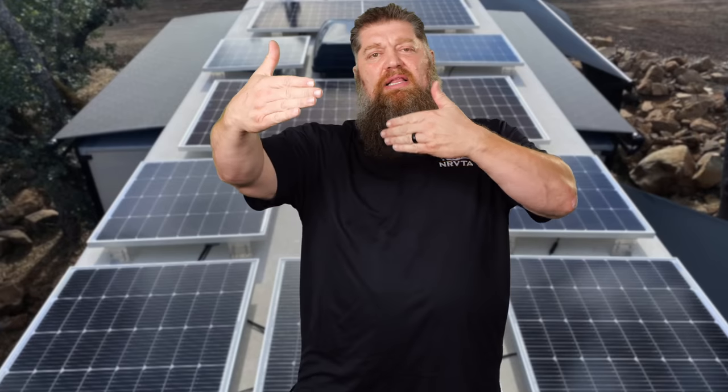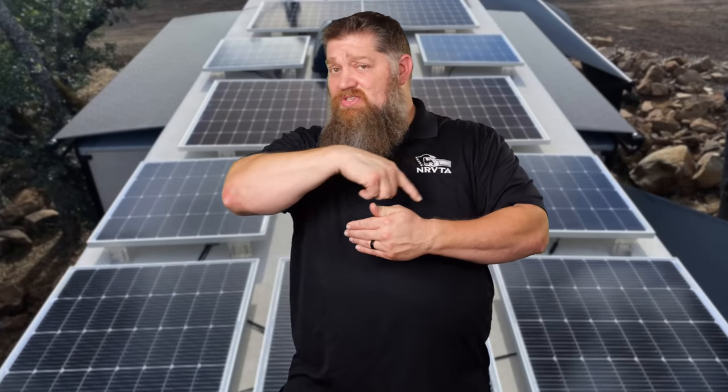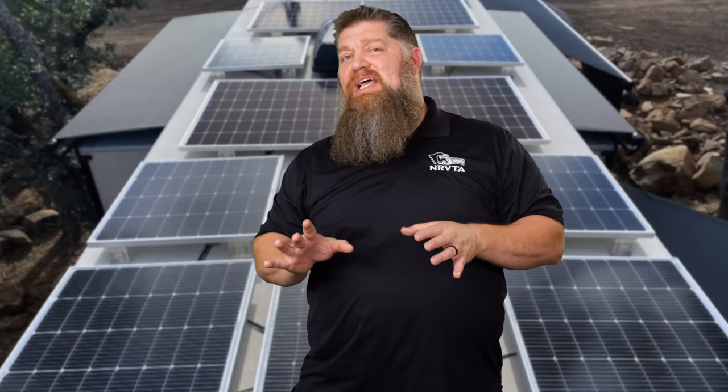When we put solar panels up, typically you don't have seals on the sides. If you have a membrane, we wrap it around the sides and put it under the J-rails. We never put solar panels on the extremities — the extreme front and extreme end — so those areas are still open and accessible. The quick answer to how you check your seals when solar panels are up there is: you don't put solar panels anywhere there are seals unless you're floating over them. You can still get up there meticulously and slowly check all your seals.